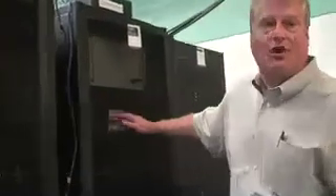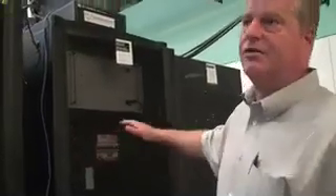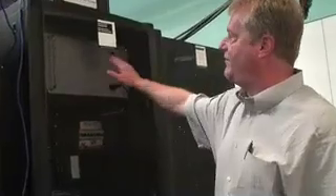We also have a rack-level demonstration. We have a rectifier inside the rack that takes 208 volts AC and converts it to 380 volts DC, and we have a couple of servers powered off that DC voltage. We also have a rack with 48 volt DC servers as a proof of concept to show that they're available, though we're not necessarily measuring efficiency gains in that particular rack.